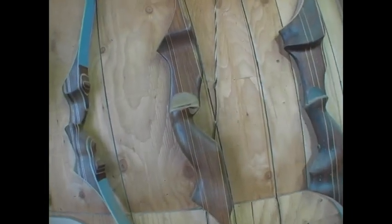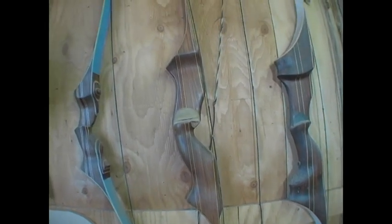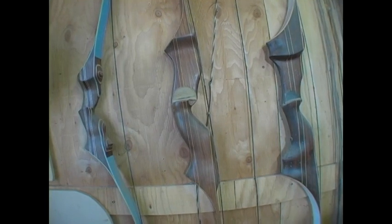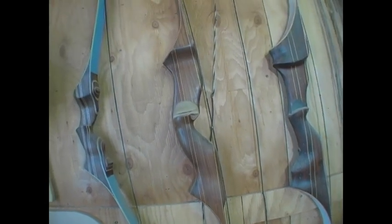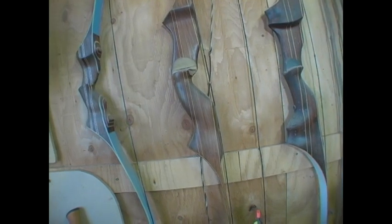Here's one that has angles — it's almost a dihedral shape. The limbs are made dihedral, and this bow was designed way back to shoot super-heavy arrows at dangerous game. I still have the form and make a few of these, but not many. The same principle applies — a jig has to be made to bring the angles on each side of the riser to fit the form, and that's what these jigs are for.